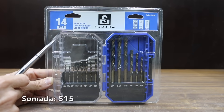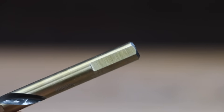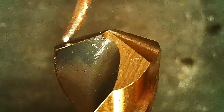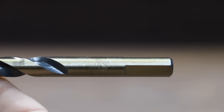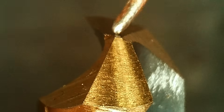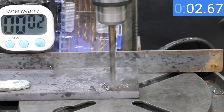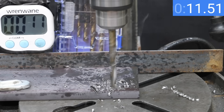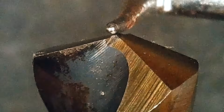At a price of $15 for 14 bits, or just over a dollar each, is this Somata brand. Unlike the DeWalt's high-speed steel, the Somata is made of M35 Cobalt with a 135-degree split point. These M35 Cobalt bits are designed for hard materials such as stainless steel, cast iron, and high-temperature alloys, as well as softer materials such as plastics and wood. The Somata is made in China. After cooling off the test piece, the Somata is off to a decent start. However, the DeWalt is about half again faster — the Somata finished in 15.84 seconds, or 5 seconds slower than the DeWalt. The Somata still looks as good as new.